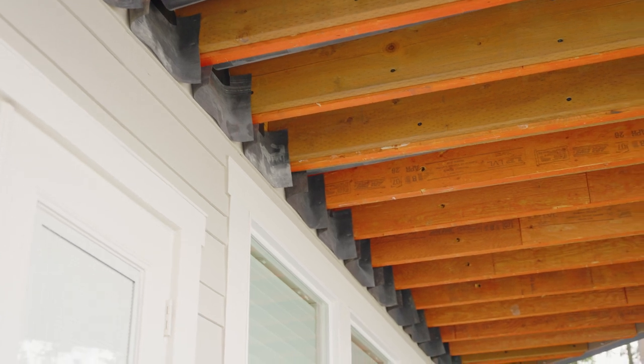The reason I'm telling you about the waterproof bladder is because these LVLs cannot get wet — they must remain dry. This deck has been fully installed. The only thing we don't have done is the soffiting over here, and we have to install a railing first as well. Once that's done, we keep the soffiting in and this section of the deck will be done. We still have to trim those LVLs down a little bit on the bottom because they're sticking down too far — because we had to raise up our joists to make them level, there's a little bit of a clearance issue there.